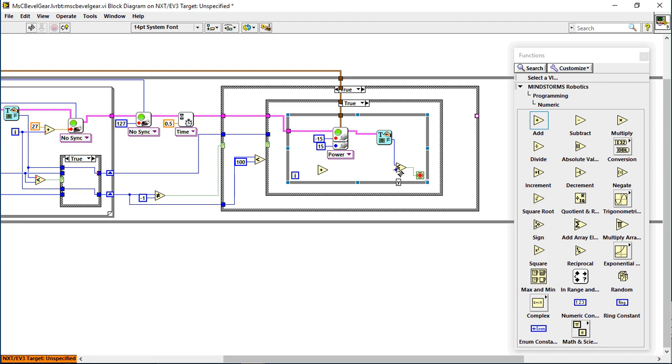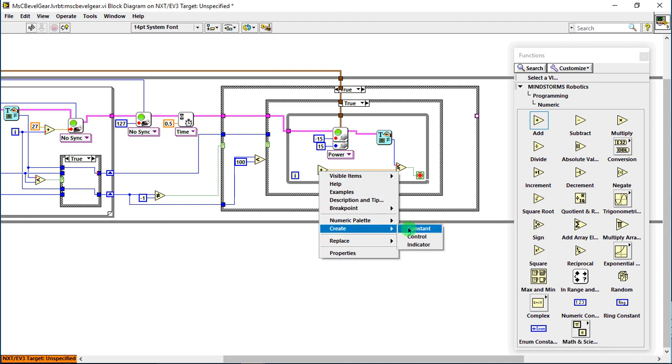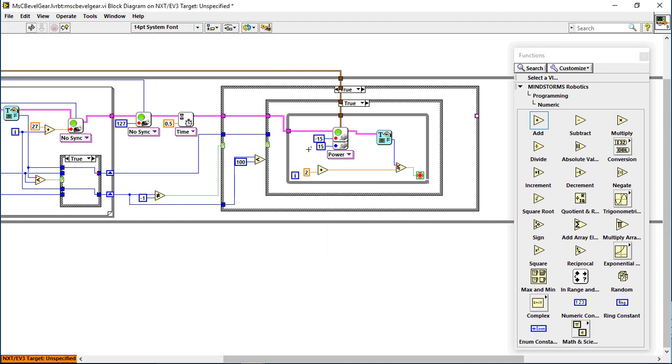And the comparison that's going on here for the Y, I'm going to go ahead and connect the tip of the plus, the add triangle. That's going to send in the value to compare to. For the plus, what it's adding on the bottom here in the Y, I'm going to create a constant and make this 2, so that way it adds 2 every time. And then the input, so what's being sent in for the X value, is going to be my value from my shift register. And it's the top shift register, it's the one that has the 50, which I put on the border here so I can easily access it. I'm going to save just in case something happens. Okay, there you go.